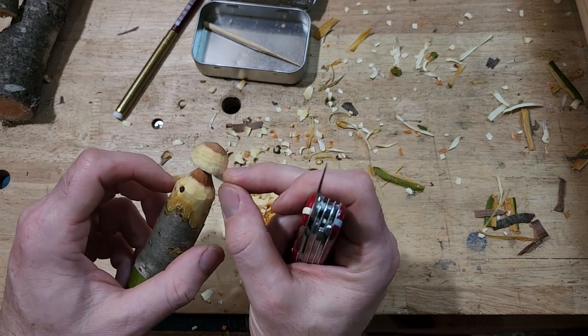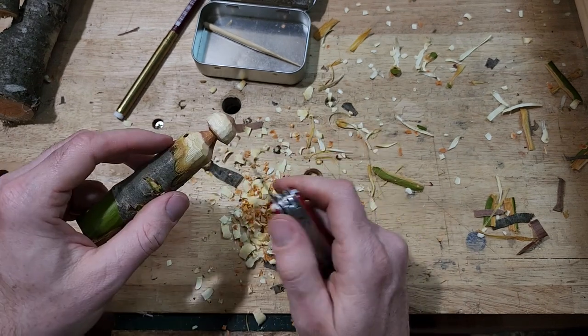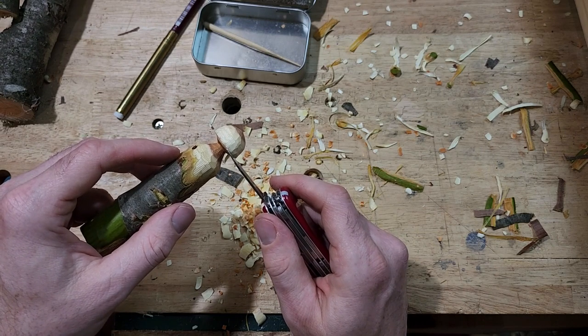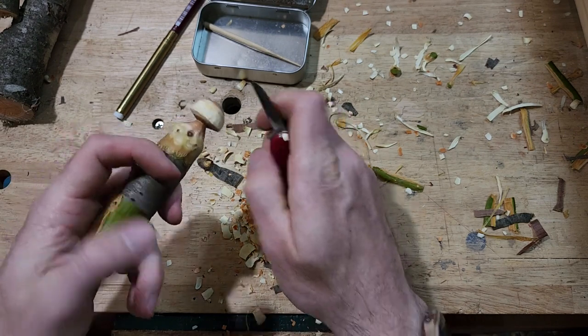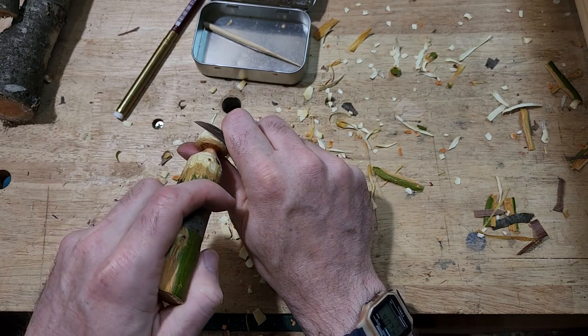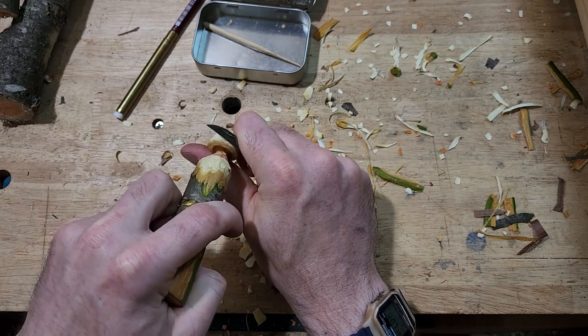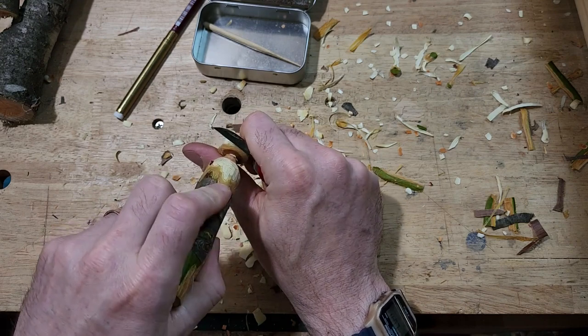This surface is sometimes a little bit messed up because of the way you come at it with the stop cuts, so I'm also kind of cleaning that up at this point. Just pushing and cutting straight across the grain to clean it up a bit so it looks smooth. It's easier to clean that up now when it is still attached to this longer piece rather than trying to come back and clean that up once you've separated it. Now I want to clean this up a little bit and work on making sure that this is consistent around this section right here. I'm going to try to find the lowest spot and then match that, going around and making small cuts to go for some symmetry. I want to chamfer this edge right here — I don't want this to be sharp.